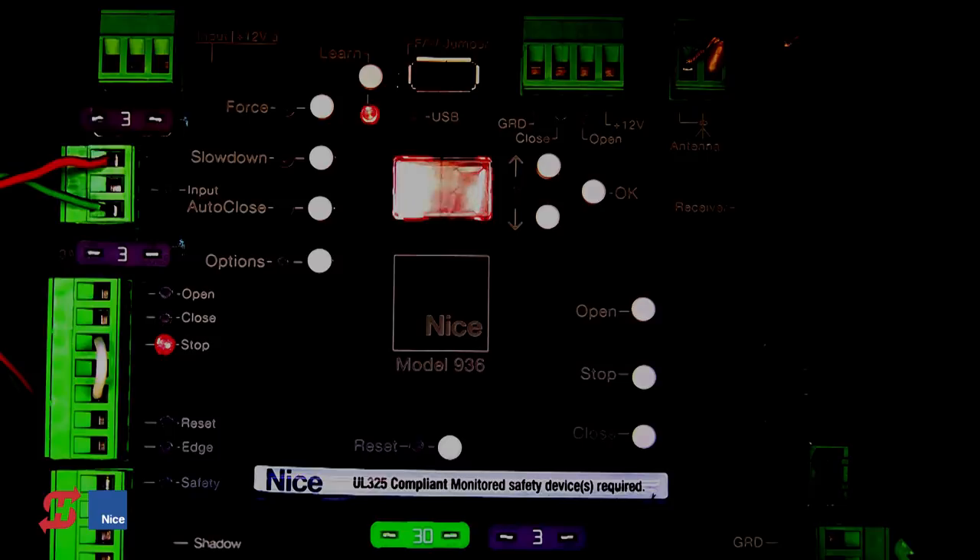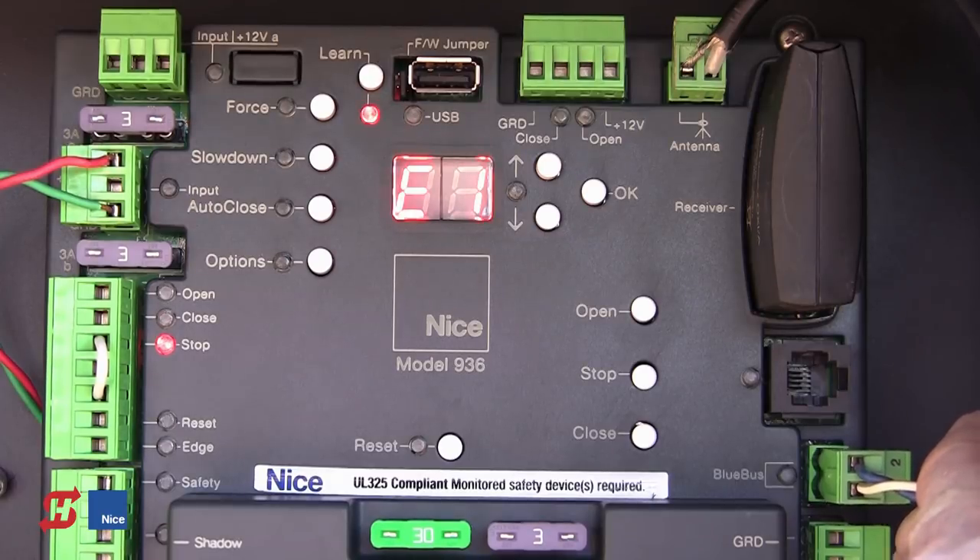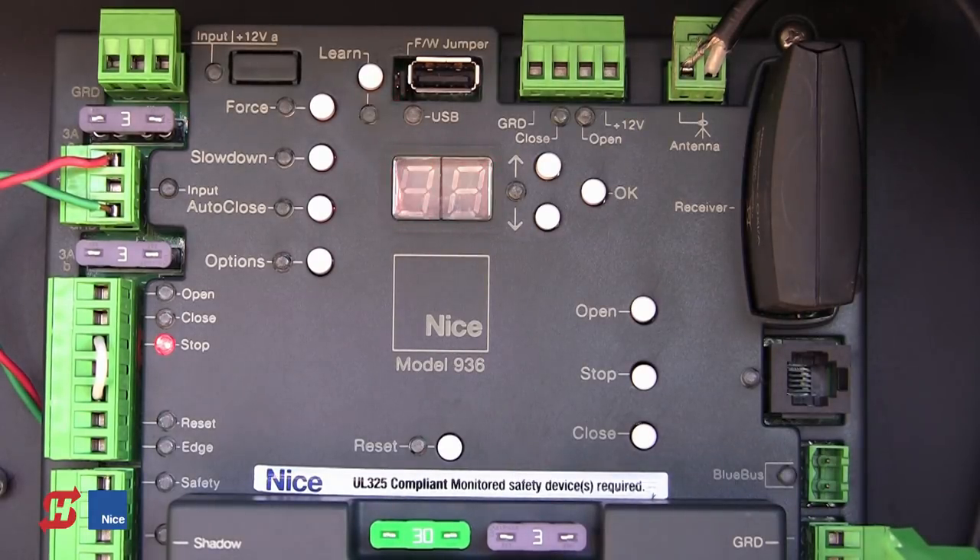In this case we're going to be using the BlueBoss through-beam photo eyes, model EPMB/A, that are supplied with the unit. These photo eyes connect on the right-hand side of the board to the BlueBoss connection. These are a very reliable through-beam photo eye provided with the unit. If you want a reflective monitored photo beam, that's also possible — you could use a device such as the EMX IRB RET photo eyes, connected to the board in a different manner and used instead of the through-beam units.